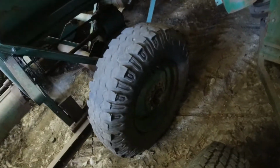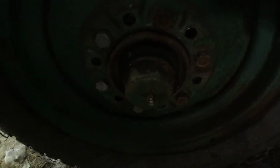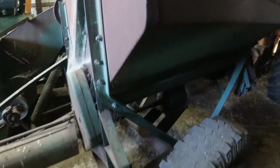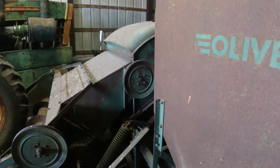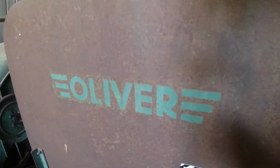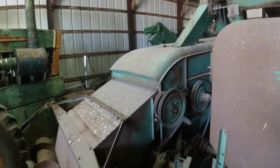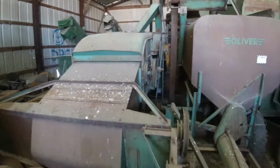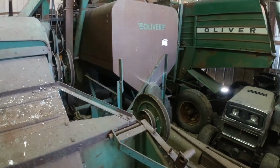I've done multiple implements where they don't fit on a trailer and I pull them home. I just go through and take the bearing caps off and get them drilled for a zerk and grease the hubs real well. And so far that hasn't steered me wrong yet. Usually take a handful of spare tires with too.